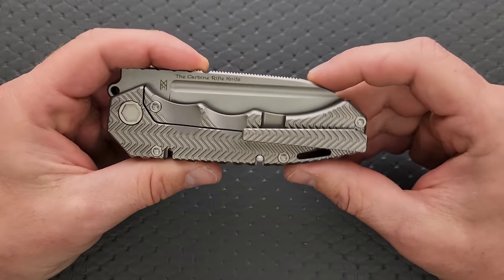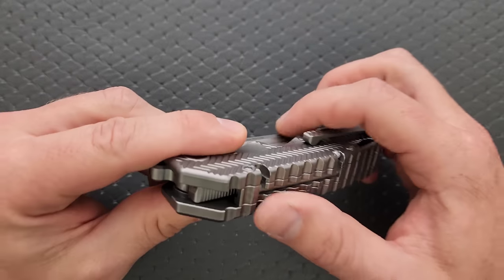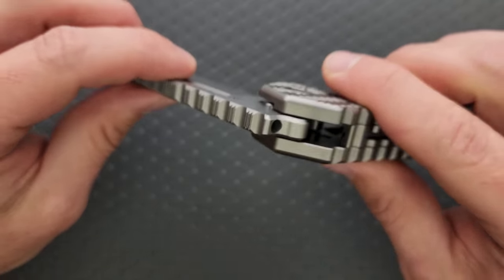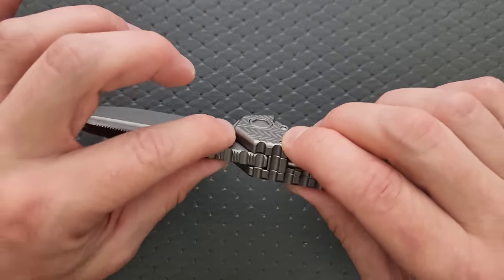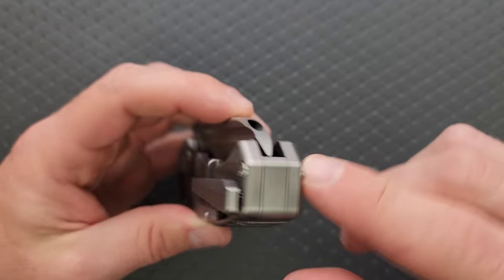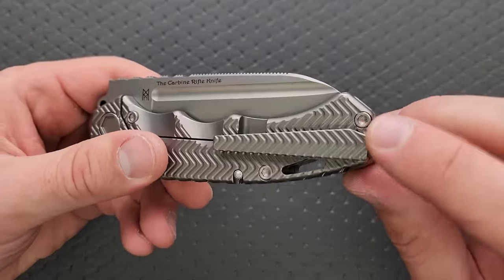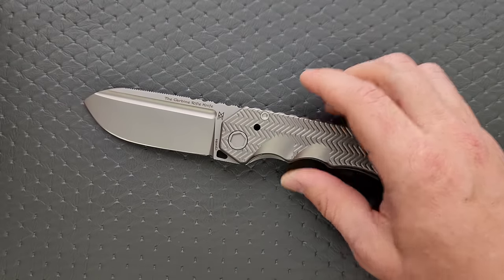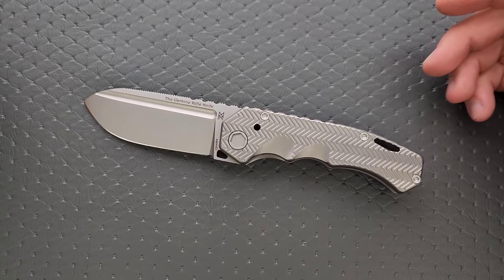They didn't go crazy with hardware — there's actually not a ton of it. You have a screw in here holding in the backspacer. The stops are actually attached to the blade, and the tang of the blade contacts the backspacer, giving three points of stability in the stop. The screws are holding in the spacer — three on each side. Not terrible, and they're all large size at least. There's also one screw for the pocket clip, located in a unique spot. So if you do need to take this apart, it shouldn't be massively complicated, as long as you have the right tools and a steady hand.